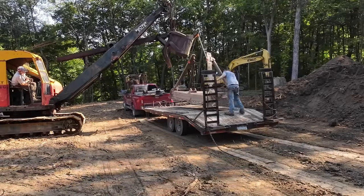While he's hauling that thing, we've got other things to do. We need to improvise a track tensioner on the D8 there. Yeah, that track's just a touch too loose. We need to fix that. All right, so to tighten up this track, what normally happens is there's basically a big grease piston in there, which pushes against the spring to absorb any shock loads. So we're kind of going to have to bypass the spring the way we're going to do this, which sucks. It's not ideal, but it's not like I'm going out and opening up a new strip mine with this thing.